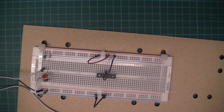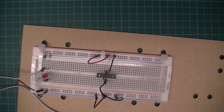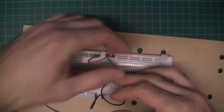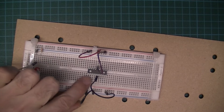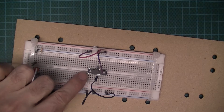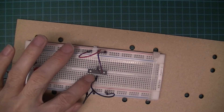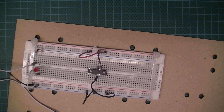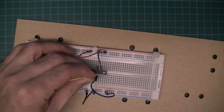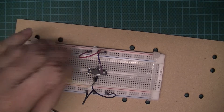Pin 1 is bottom left. Pin 14 goes up to the positive power supply and pin 5 goes down to 0 volts. That's almost all the PIC needs - just power. However, pin 4 is the master clear, which is active low, meaning it resets when low. To stop it constantly resetting, you need to pull it high. Because we're using a PICkit, we'll use a pull-up resistor.